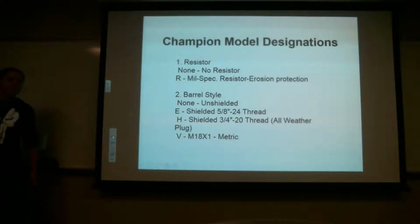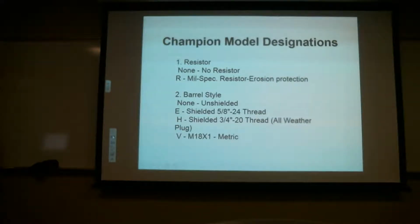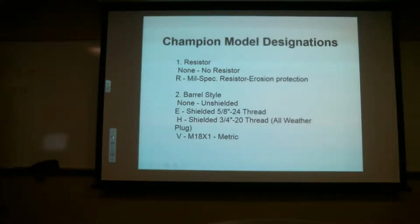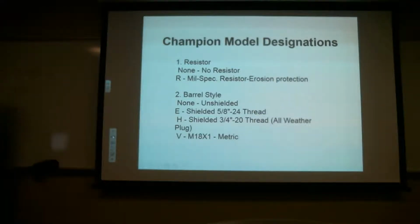There you go. Just like the other ones are 20 threads, 24 threads. Something like threads per millimeter or something. It's thread pitch. It's actually a 1 millimeter pitch. Is that per thread? Is that what you're telling us? Threads per millimeter, I think. I'm not gonna lie, I don't know. 1 millimeter is the pitch. From the top of one peak to the next is 1 millimeter. So it's the thread.